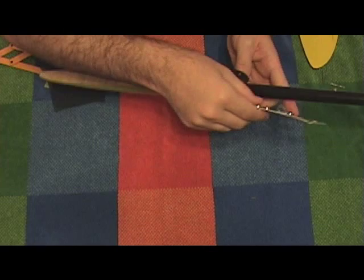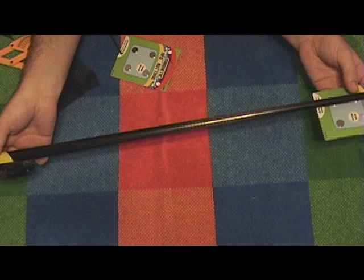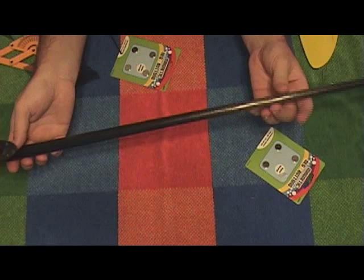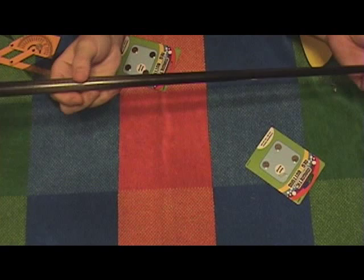I'm going to run magnets along the side of the boom, and these magnets are going to hold that metal rod against the inside of the boom. And that metal rod, since it's inside of the push rod, is going to hold the push rod against it. From this end I can hold it up and drip thin CA down it, and the thin CA will run down the length of the boom along the inside and stick everything together.